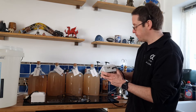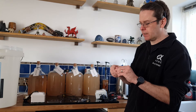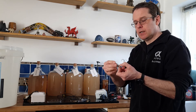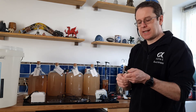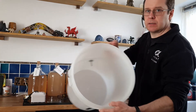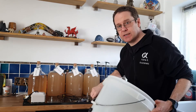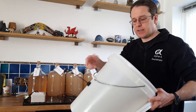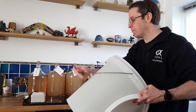The whole idea is that I would need to install a thermo well into the bucket. A thermo well is an amazing invention — you drill a small hole in your bucket or boiler, push this in and do up the nut. It now sits in the bucket with a plug in it, and it's hollow, allowing you to then put a temperature sensor in. You can slide it in and it reads the temperature from inside your brew without any contacts or leads dangling in.